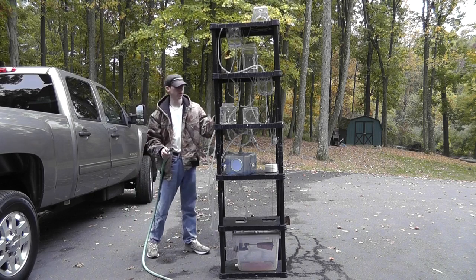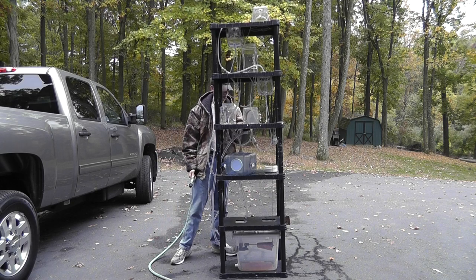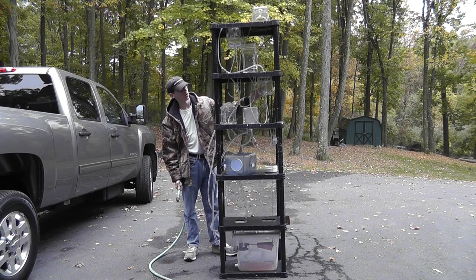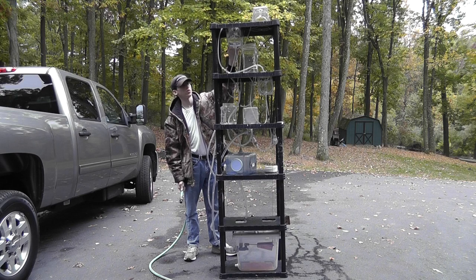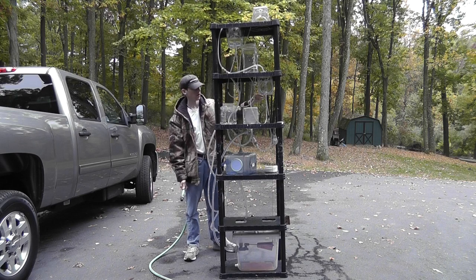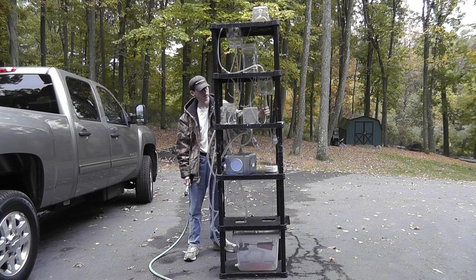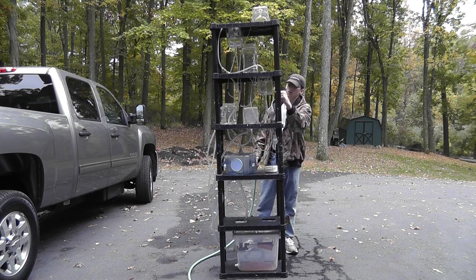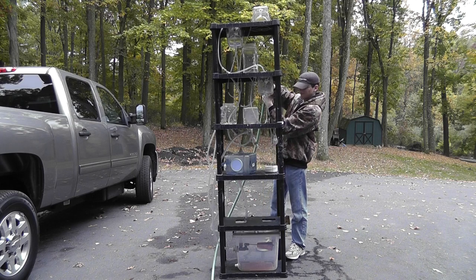right here. So basically what you do is here's the input tank and here's the feed tank. You're going to put the caps on this right here. Now with the stage 2, which is this tank right here, and stage 3, you want these to be closed off, and you also want to be primed too. When I say primed, I mean you have to fill them up to a certain level in order to prevent the air from going into these pipes here. So what you do is you fill them up just a little bit to cover over the connectors here, like so.